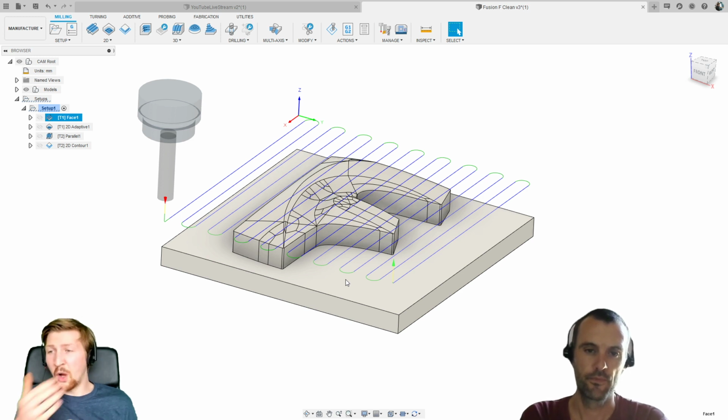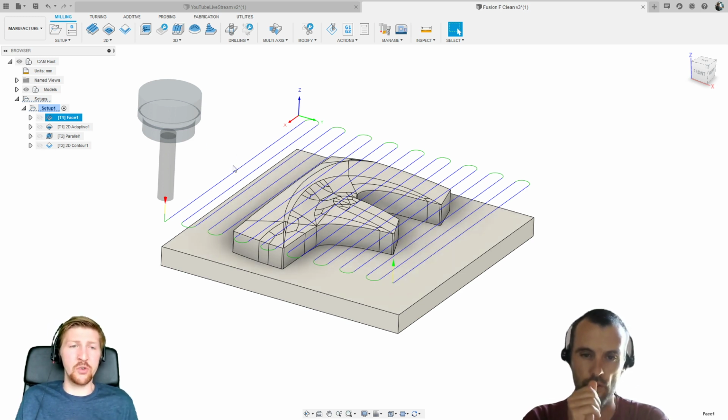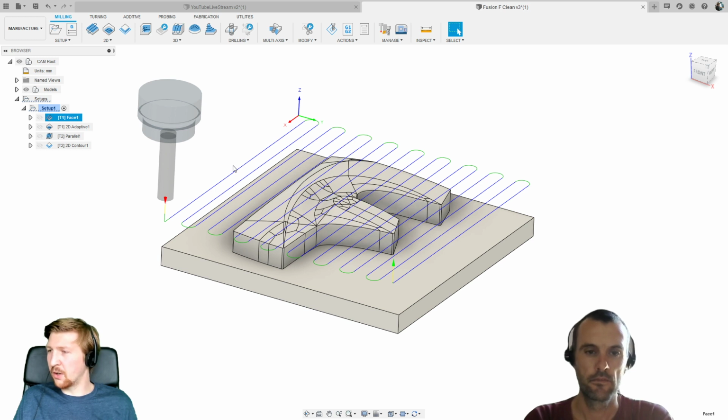But again, I wasn't machining it, but I did see it, and it was pretty rough when it first went on the machine. We might have got away without doing the facing pass on top, but it's just good practice to always face your material off, especially when it's been rough saw cut. Maybe we used the chainsaw to cut the blocks up from the stock before.